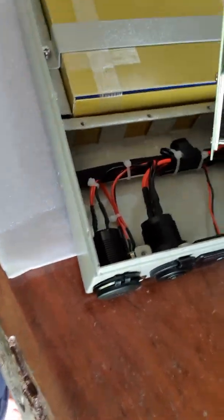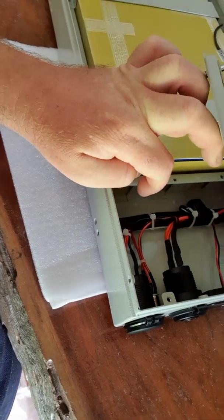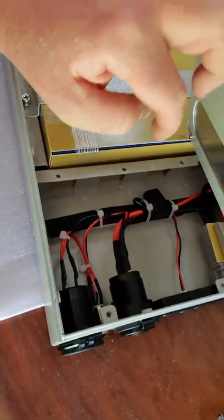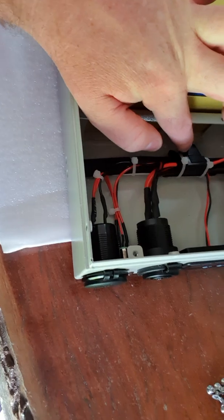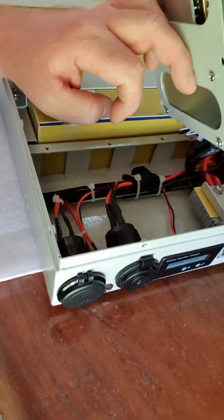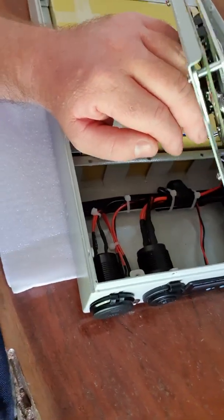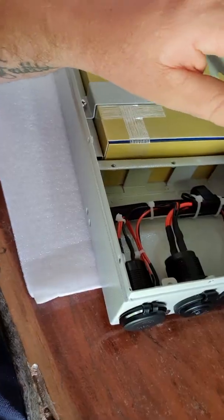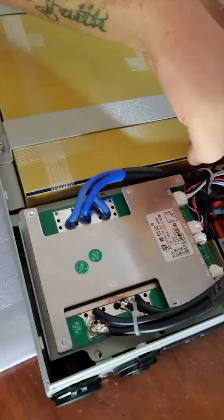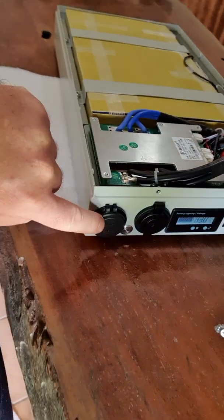There's a metal rail allowing the wiring to be secured, with rubber on top so the wire sits on rubber rather than bare metal. There is a mini fuse in here feeding the socket and USB ports, which it does need. However, you have to pull the BMS up just to get to it, so I'd like to suggest a resettable push-button or flick-style circuit breaker - just to make it easier to reset or replace the fuse.